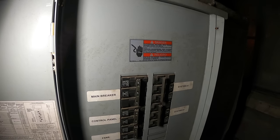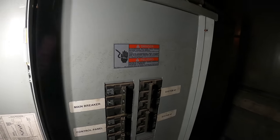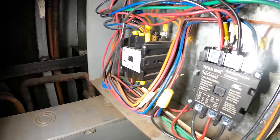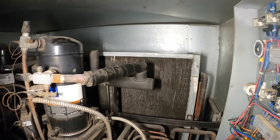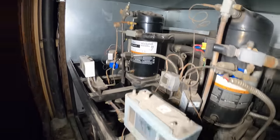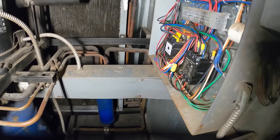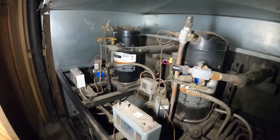That should be inspected or replaced, and I should look into the power wire coming in. All the wires are cleaned up, nothing's burnt, new connections, good connections there — compressors are okay. Yeah, gotta call an electrician. We brushed down the coil, fixed the broken wires, changed the contactor — definitely time for a bit of an electrical update here.